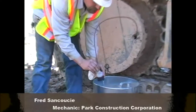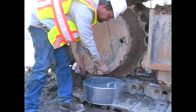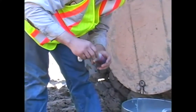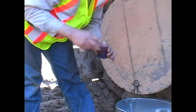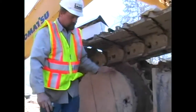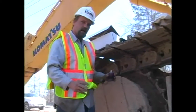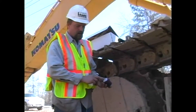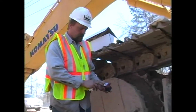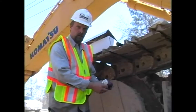Once you have the sample tube about halfway, just remove the tube — that takes care of the suction. On excavators, the final drives with the sprockets will always be considered the rear of the machine, that way you can differentiate between right and left side. Mark the bottom with the oil weight, which is 30-weight on this machine. It would be labeled right planetary. That's how you pull a sample on the final drives.